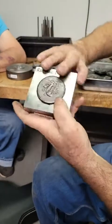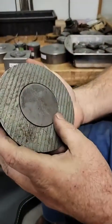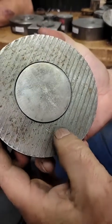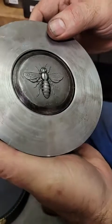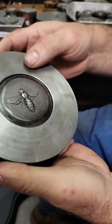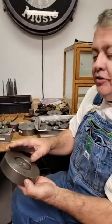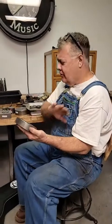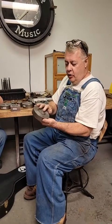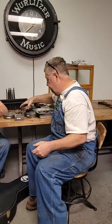In order to use tools and dies to make these things, we have to use hardened steel. We've collared things — put collars around them — because they're being driven to hundreds of tons. There's one that's cracked, but that collar actually keeps it from exploding apart and it's been used hundreds of times. Ron carves a lot of his stuff in the negative, and I've been telling people — skip the hub, go right to the die and start stamping.